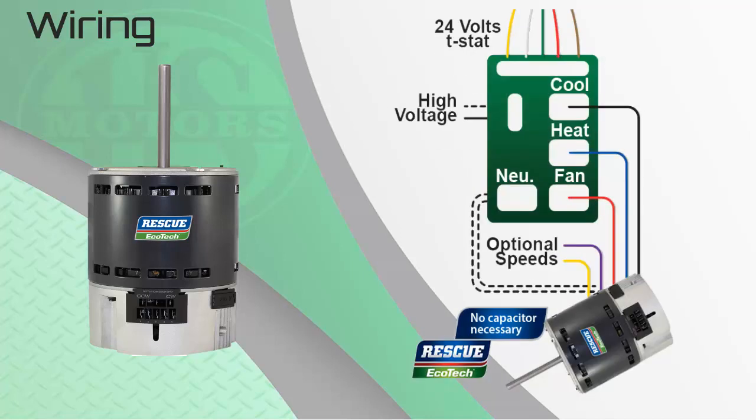Here's the EcoTech wiring example. Notice essentially the same high speed for cool or AC tap, and medium to heat and fan speed to low. The only major change is there is not a capacitor with the EcoTech. The person doing the installation has to make no additional changes to wiring to use an ECM product in place of a legacy PSC motor.